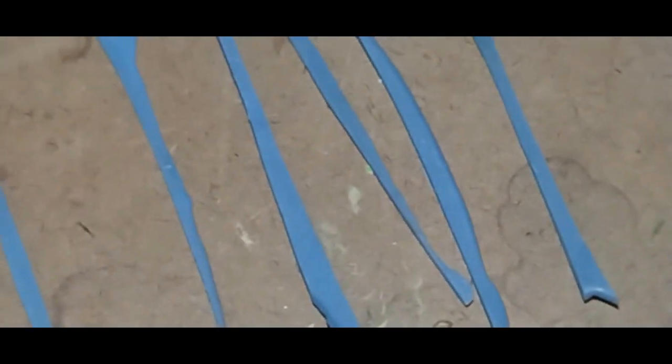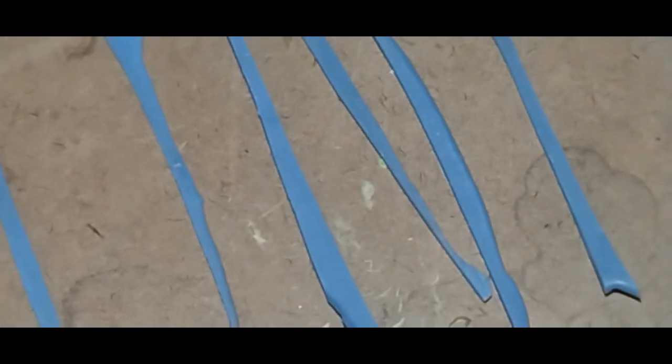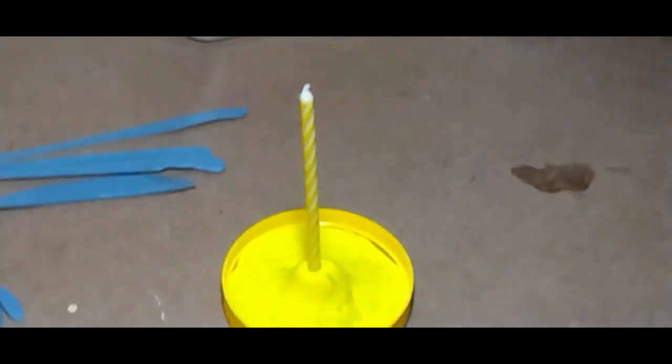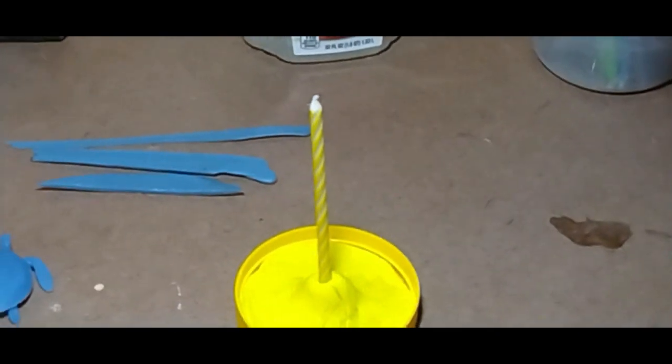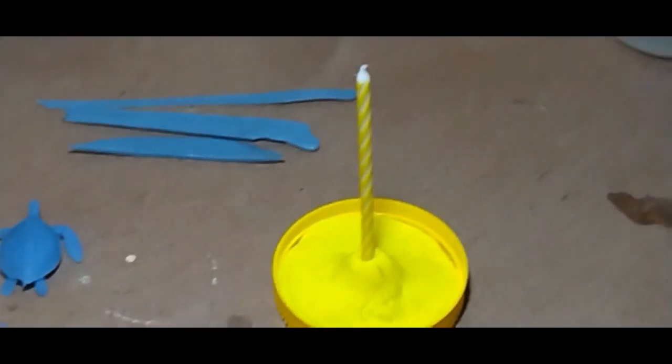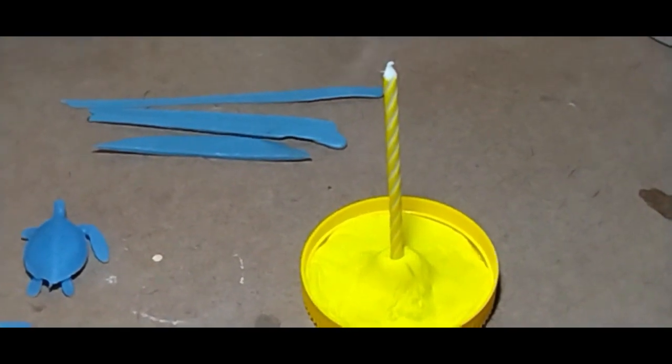Right here is my sprue wax. A good way to make sprue wax — what I do is I just take my wax injector and take a piece of wood and stick it up against the nozzle and let some wax run out. Then I end up with this wax and I just cut strips. For sprues you really want your wax to be a little more round, so I'm going to kind of round these edges. Then I've got my birthday candle right here — I'm going to take my knife and heat the tip on that birthday candle and go ahead and sprue this turtle up, then get him on the sprue base.